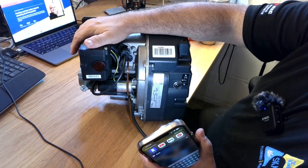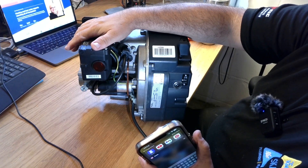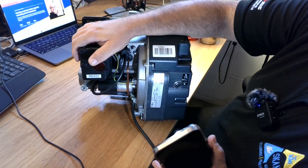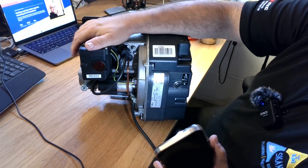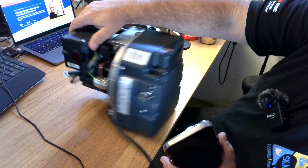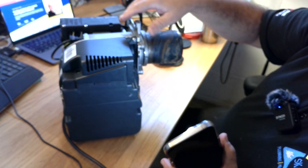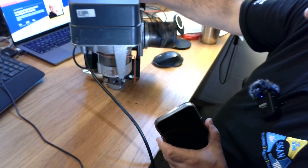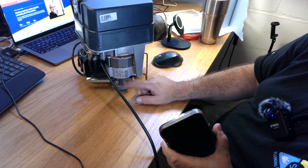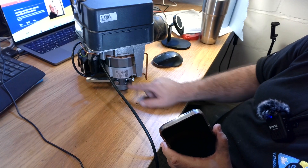And this is the very famous reset button. If something goes wrong on the boiler and one of the sequences it is programmed to perform doesn't work correctly, it automatically locks itself out. You then have to manually press the reset button, which signals that someone is monitoring the boiler and can react if something goes very wrong. Underneath we can also see a little of the motor and its details, as well as the inlet point of the oil pump — this is the inlet point.